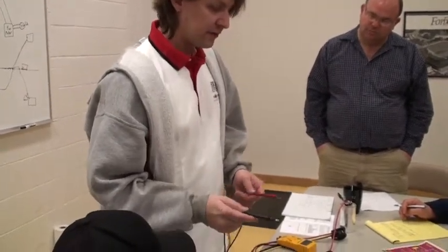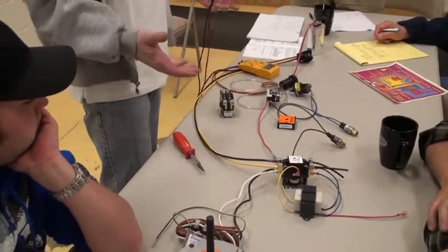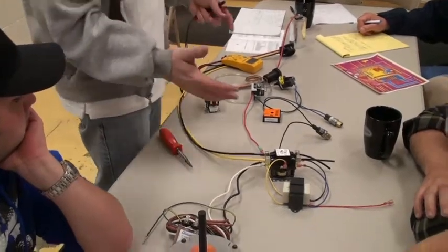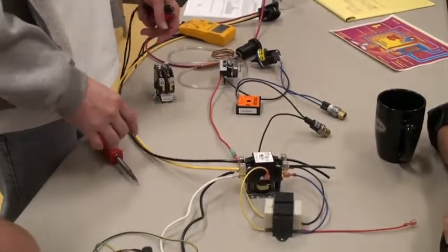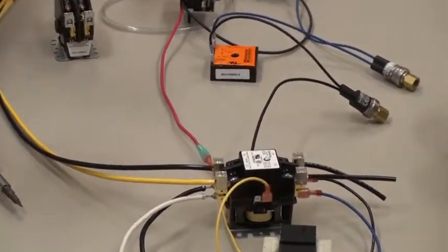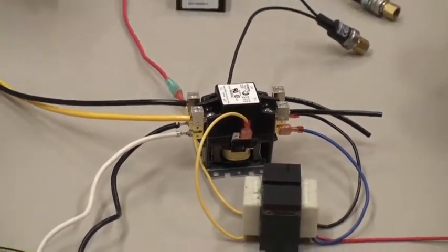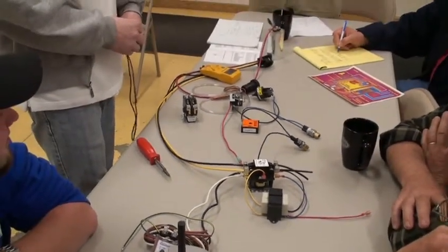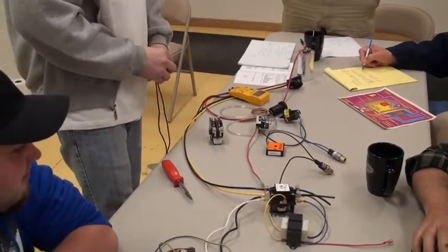All right. Once you verify you got the 240, then you have to start thinking of your symptoms. Why am I here? Was this cycling? Is there something visually wrong with what I see? Do I see charring here? Or if it's rodent damage, you kind of just have to inspect for wires chewed, make sure all the wires are clean all the way. Do you guys ever see mice in there? That's just a matter of nasty smell, and you stick some gloves on and wash your hands.